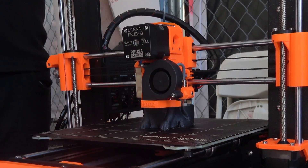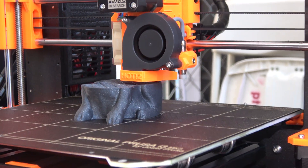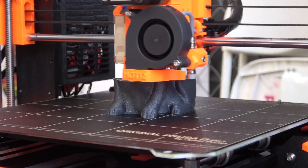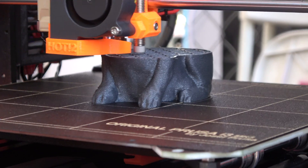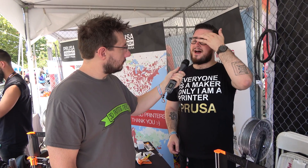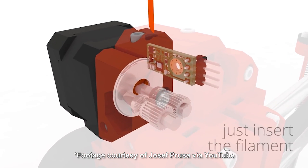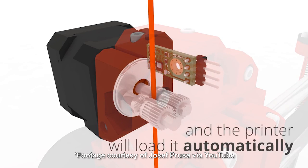We are known for improving the printers even once they're out because we have a lot of sensors, and we can do a lot of stuff with firmware we never thought of during development. So when we detect the extruder jam, we can also offer a cold pull — it's still better to try a cold pull than throw away a 20-hour print. With the sensors you're able to detect when the filament is inserted, which will then start to grab it rather than having a timed loop.